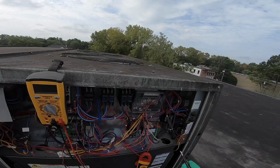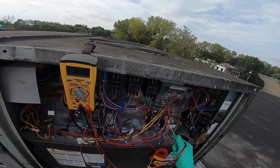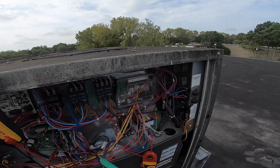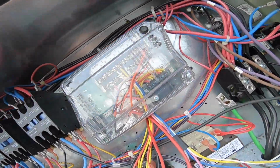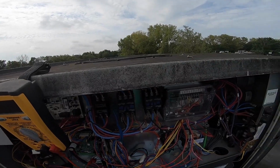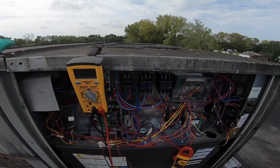I'm not seeing anything. It's not shorting, it's not tripping. Yeah, I've got to tighten up some wires. I'm not going to touch and tighten, but it looks like that's just how the contactor is, a little longer on these terminals. Because both, yeah, I see the brass is to the bottom. Brass to the bottom, so those are on good. All right, this is what it is. But now why was I tripping? It has to be because of voltage.